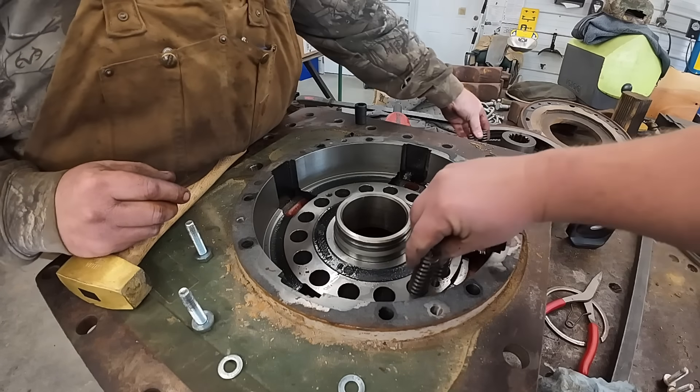Normally when that code pops up, we wouldn't be reading any RPM. So it's kind of a weird deal. A little speed sensor is right in there on top of that pump. Basically there's a tone ring in there and it's just reading the RPMs off that — it tells the computer how fast it's turning. That does not fix it. We'll probably take that transmission controller off — it looks pretty old. We might test a couple capacitors in there. Kind of got to be quick on changing these because there is oil that will come out.